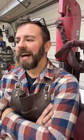We're gonna let that get really hot. Well, pretty much what it was before. And we're gonna run it through the flattening dies and square it up, make sure it's all nice and even. It may take a heat or two to get it right. Because the squarer, the flatter, and the straighter I get it at this point, the less work I'm gonna have to do when I go to restack it, and the more even the pattern's going to be.